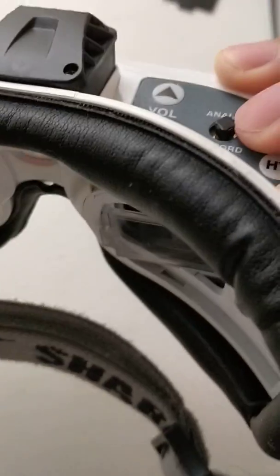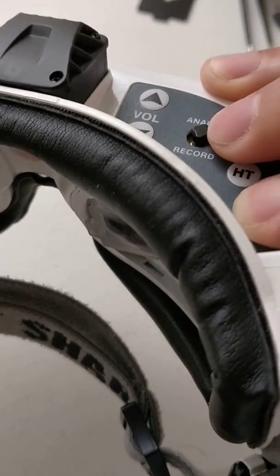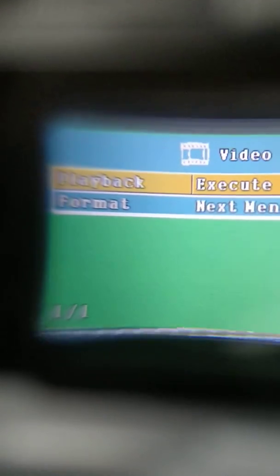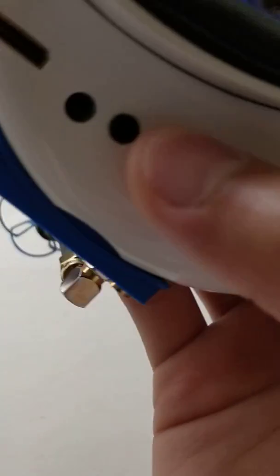So this is forward towards the front of the goggles, and back is towards the back of the goggles. So if you want to exit the menu, you'd push the joystick to the left. So push the joystick to the left, you return back to that menu, and if you push it to the left again, you exit the DVR menu, and everything's black. And to get back in business, to start seeing your drone stuff again, you just pull the switch to the 1 position, your module turns back on, you get that snowy screen, and you're ready to fly again.